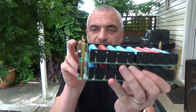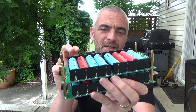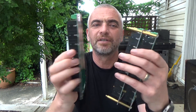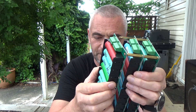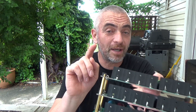So now instead of two in parallel I have four in parallel, which means instead of 4,000 mAh or thereabouts, I now have 8,000 mAh in a battery that is tiny and weighs next to nothing. When I stack the third set on, taking quite a lot of care that I've got positive touching positive and not the other way around — which could get quite exciting — now I have two, four, six, eight, ten, twelve amp hours. That's quite a bit of battery, still weighs very little, it's very small, very simple.